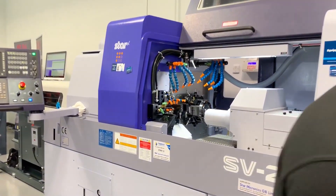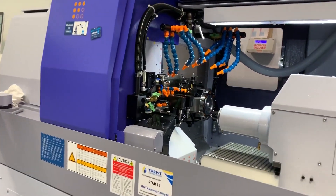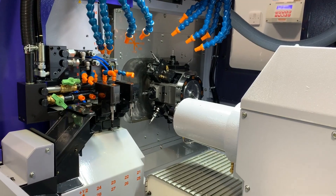I also looked at this in a bit more detail and thought to myself — and I'd be interested to know your thoughts on this — the actual cutting strategy and the configuration of a sliding head lathe means all the tools are far closer together. So you can go from tool to tool far quicker than if you're on a machining centre and you're having to tool change and come back out, which could take even on a fast machine, you know, one and a half seconds. But here, there's no idle time. The savings are astronomical. The actual chip-to-chip time — the actual time the part takes to make complete — is reduced significantly.